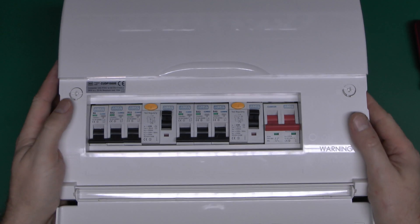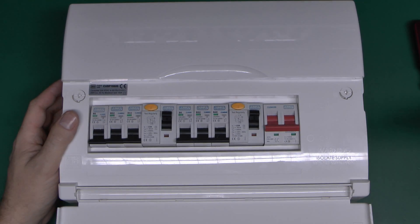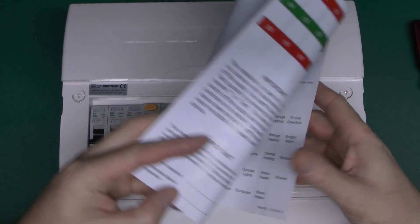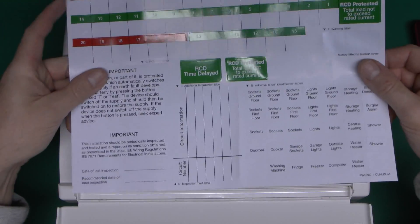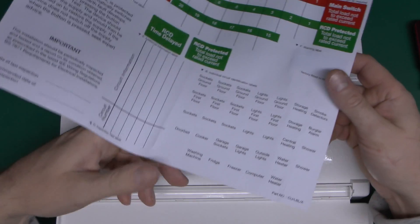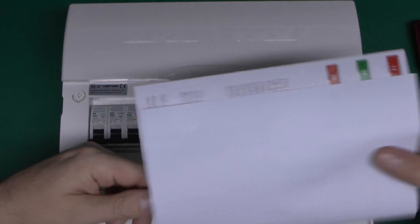The cover on this one just slots over there - so we've got them lined up correctly. All of these are actually supplied with a whole sheet of labels. Even the very cheap consumer unit has always come with a whole pile of labels to stick along the bottom indicating what the circuits are. But sadly, it's very common to see these installed with no labelling. It's just being lazy, because it's not exactly a big deal just to peel off the appropriate label and stick it in the appropriate place.